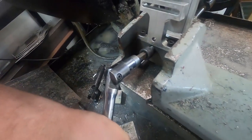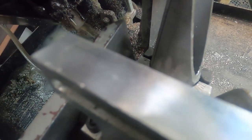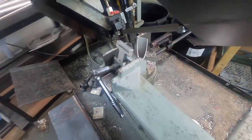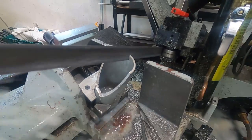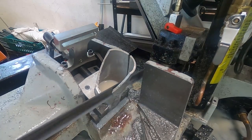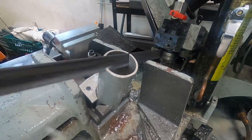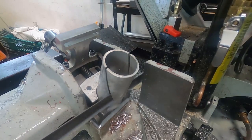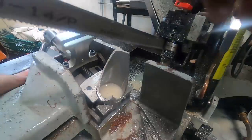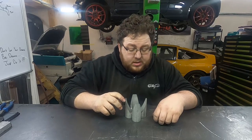We've done our first cut. Now we're going to loosen it from the fixture, take that mark round 95 degrees and then slightly over to roughly 97, lock it down, and go for a second cut. That's all four pieces cut.